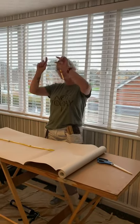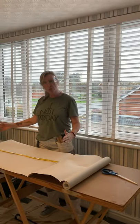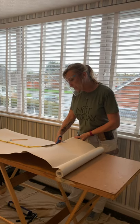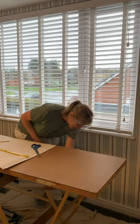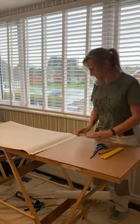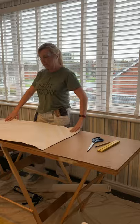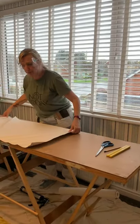I've only got two pieces above the door frame. What I'm going to do is cut a piece as wide as the door frame — I've just measured it and it was 900. So I'll cut a piece at 900, paste it, press it, turn it over and paste it. It doesn't really matter which side of the line, but get into the habit of always opening it that way and turning it over — that's how you do it with a finished paper anyway.